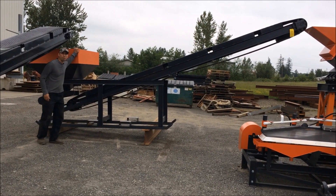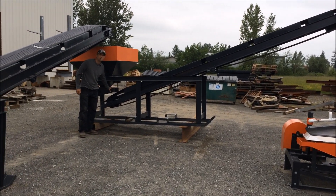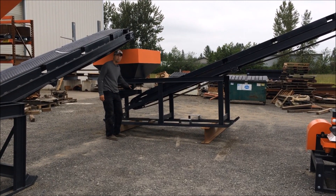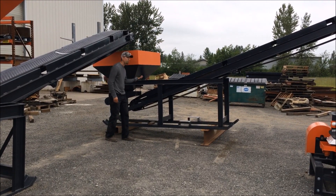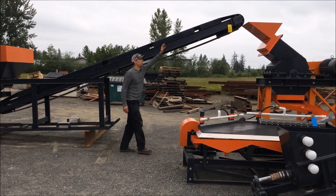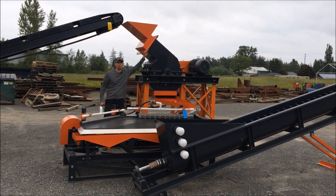This is just a holding bin for the crushed ore. There's a magnetic feeder down here that's adjustable, so you can very nicely and evenly control the feed rate from the fine ore hopper onto this conveyor belt that takes the crushed material from the jaw crusher up into this 24 by 16 inch hammer mill.